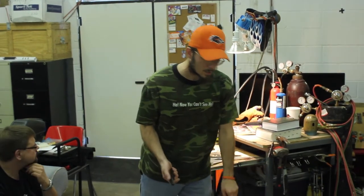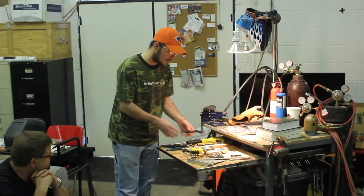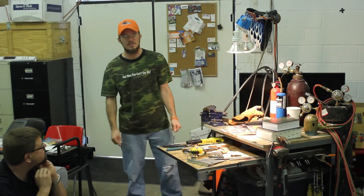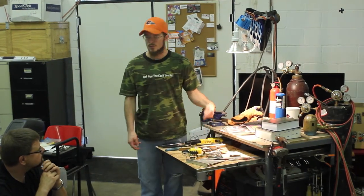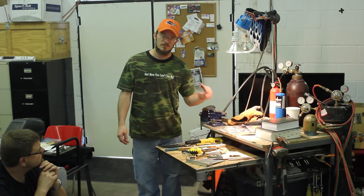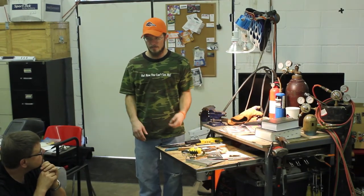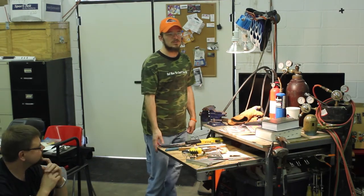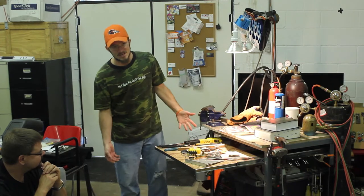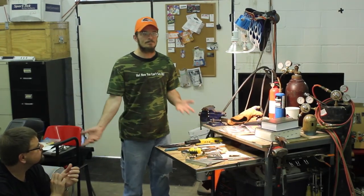I usually have more. Another tip is to have different wire brushes for your aluminum versus your steel versus your stainless steel. The little bits get impregnated in the brush, and you'll literally see rust on your aluminum because you used a brush that you had used on steel. It's got little bits of steel all over it, and it magnetizes itself, and just makes a mess. It will actually infect your aluminum weld. Now, are we making space shuttle parts here? No. We'll probably never see it in our lifetimes, but it's out there.